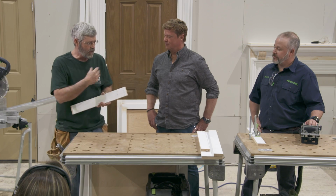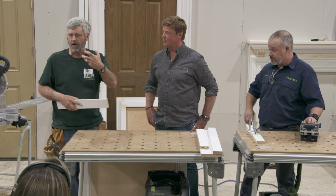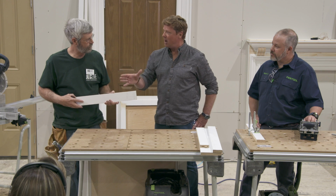But buy good material. Often if I'm buying something, of course, this is a great product. This is a Windsor One product, which is very dimensionally true, with square edges, a great product. But if we do rip it, we probably want to do something to the edge so that we've got a clean edge, because a saw cut does not give you a good joint. And our friends at Windsor One have a booth here. They were generous enough to let us use some of their stock for this project.